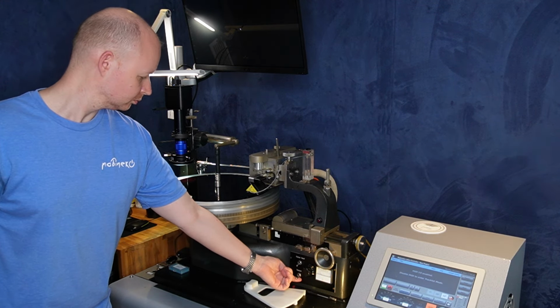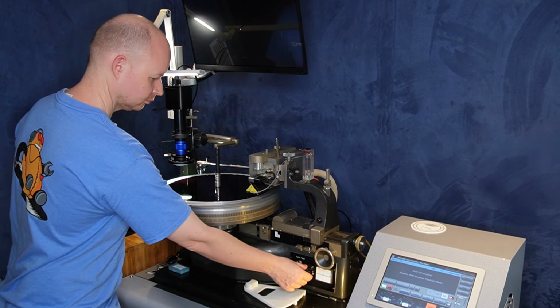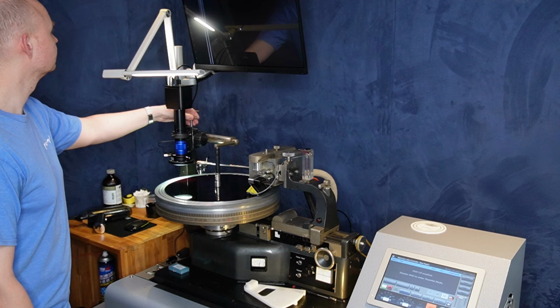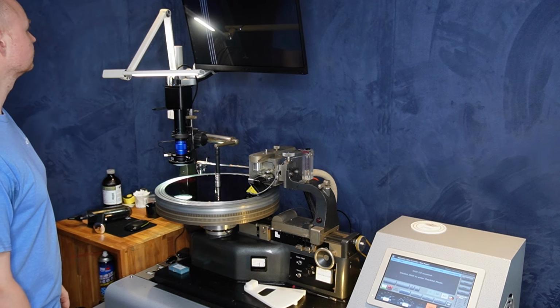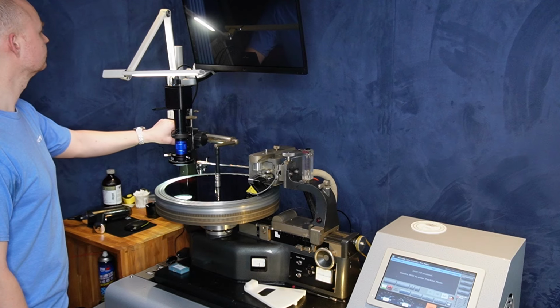Now I need to switch on the vacuum and stylus heater. I now need to make a test cut with a silent groove and inspect that with the microscope. A master lacquer is usually 14 inches in diameter. We can cut anything up to a 12-inch on that, and we use the extra space for test cuts.